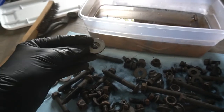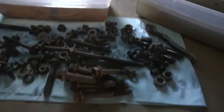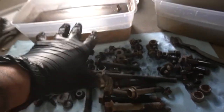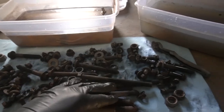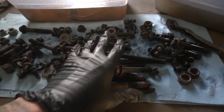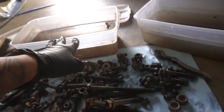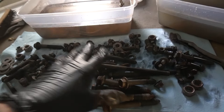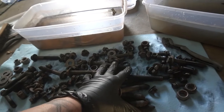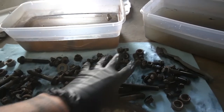A lot of the washers look brand new — no rust, no corrosion. A lot of the bolts are completely bare and look really really good. There are some that still have corrosion, so I'm going to put those back in the vinegar for another four to six hours. I also ordered a tumbler which should arrive today, so once these are back out and cleaned up we can throw them in the tumbler to knock around for a while. I also contacted a friend who has a parts washer and he's going to let me use it.